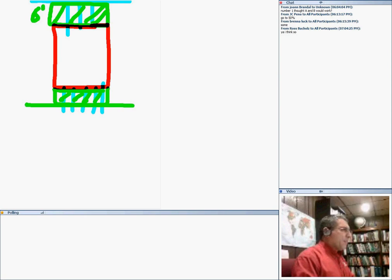So, my friend, if you have a mechanical contractor who wants to bring a big duct right into this space, that's a violation of the code, and you have to go pick a fight with that young fella. Or you have a sink. How about if I put a sink right underneath here? You can't put a sink. This is the space for electrical equipment.